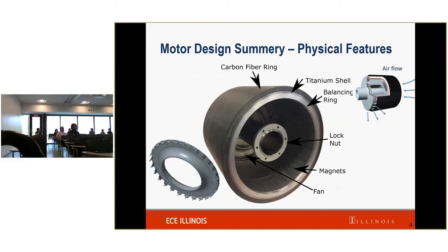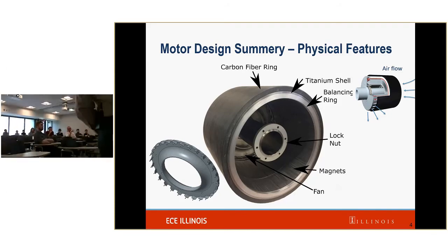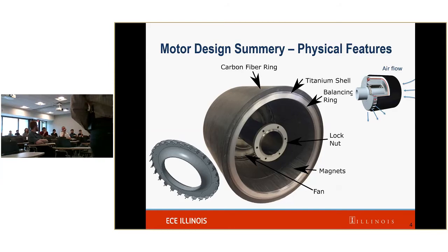Trying to get a feel for the Young's modulus and strength of the carbon fiber. Wasn't it wrapped and then machined smooth? You have a thickness, and then they assume a certain packing factor. The way that they wrapped it is in a really specific way, and they know exactly how they wrapped it, and what that dimension is. So the numbers are we did 40 wraps: 10 in the hoop direction, then 2 at the 45 degree direction, then another 10 in the hoop direction, and then 2 at the 20 degree direction. Now you have this information of what all the directions are that go into this.